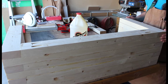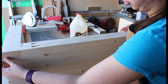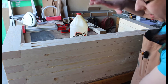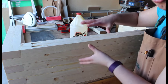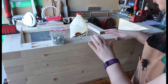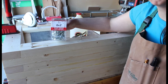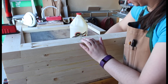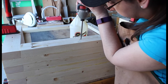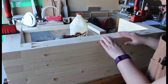What I like to do is just put it on, let it sit, and kind of line everything up a little bit to make sure some areas are flush. I let it sit for a bit because when you add the clamps it can shift and move everything — this way the glue can settle everything into place. Then put clamps on each side and drive in your number 8x2 inch wood screws.